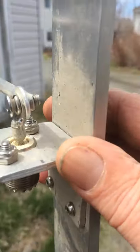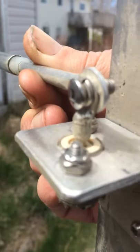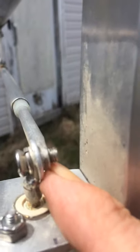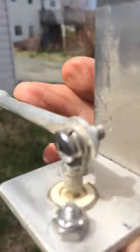Of course there is a bracket for the connector. The gamma rod is a quarter inch aluminum rod. On the end I flattened it, drilled a hole and ran a tap through there, and the screw goes right into that — so there is no need for a nut, no chance of a nut falling off.